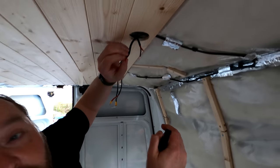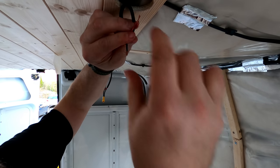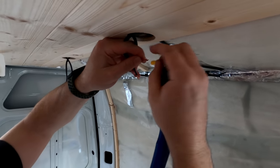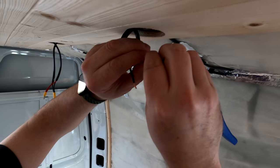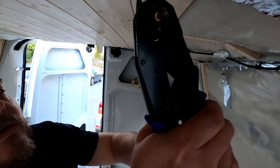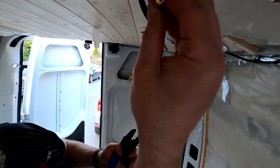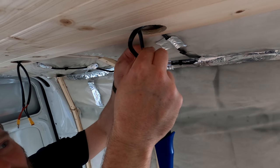We're going to get the wiring in and just check that the lights work okay. So we're going to be wiring these lights up in parallel — that means red goes to red, black goes to black, and then the same connections go on the LEDs. So I'm going to crimp these two wires together with one of these connection terminals. That's that one connected, and it's just the same for the black one, then we do that around all the lights.